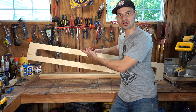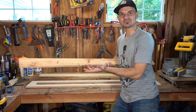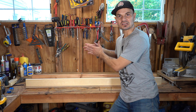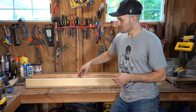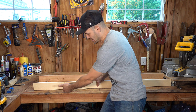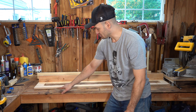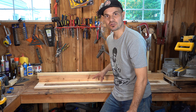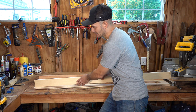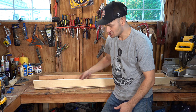You've got your deck board out and ready to go. Next thing is your two slides — I got a one-by-four, cut it down to three inches by five feet, one on both sides. Those are going to lock the router in place. I'm going to use my Kreg jig to drill some pocket holes. It's very important — you don't want your guides up against the sides, because if you drill through the sides into your finished plywood it's going to raise a little bit. As you run your router it'll be going up and down and you won't have that smooth transition. Make sure your guides are on top of your deck, then toenail those screws every foot or so to lock the rails in place.